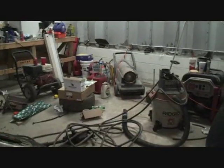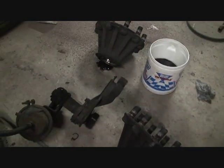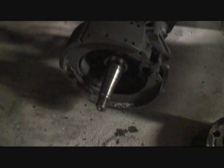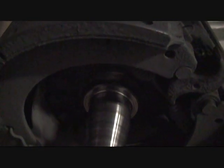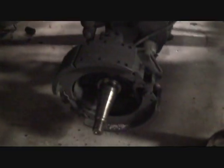This secondary heater is for when I've got the door open — it blows the heat in the direction I want. But it's 60 degrees here today so I shouldn't need heat. I'll work on this tomorrow on Christmas Day. It'll probably take me longer to clean all these parts up and clean the grease and oil off the wheels. I've still got to pull this other side apart yet. I got it down to where I could see the bearings to see if I needed to get bearings and races, but I don't. This one has a seal saver — it's a shim that goes over the race where the seal rides to give it new material to ride on. I've got to take that seal saver off because they didn't have seal-saver wheel seals, so I just got the standard green ones.